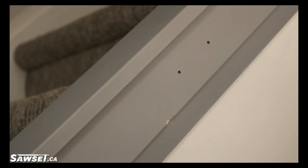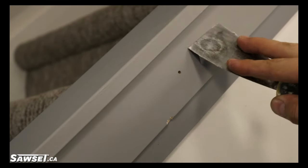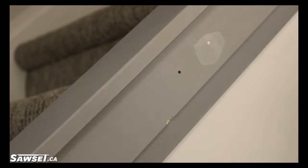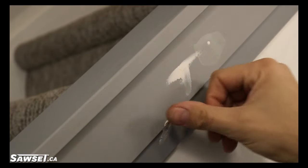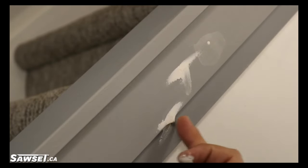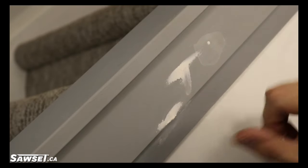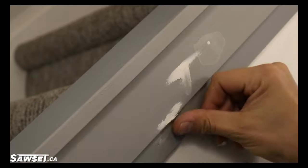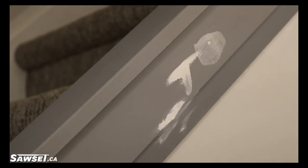Now that we've made a whole bunch of nasty holes, we have to make them go away. Two ways of doing that really. One is you use a putty knife and just sort of go over it, but as it dries there's a tendency for it to shrink, so you might want to hit it twice. Your second option is to lay a thicker layer over top, kind of smooth it out. As it dries, if it does shrink, it leaves a little bit of excess so that it doesn't indent as much once you sand it. Simply wait a little bit, sand it down, and you'll be good to go.